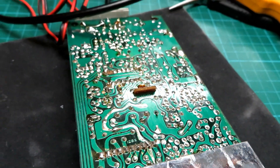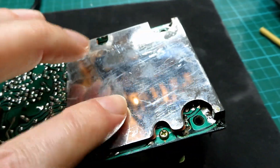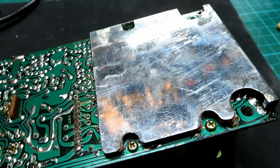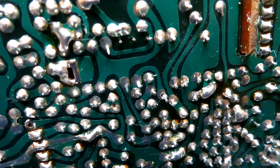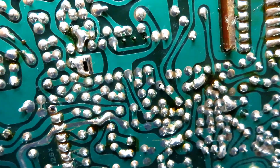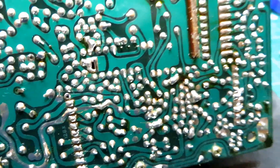I'm going to quickly rework some of that with the soldering iron and see if that brings anything back. We'll take this shielding off here — there's one more joint on the board. Sometimes if the radio has been in a damp environment or spent a winter in a boot, you can easily get condensation under these shields. Let's have a look — and indeed I think I've found the problem without even getting the soldering iron in there. Right in the centre of the picture you can see a little broken leg there, and that was underneath that screen. Always worth taking those screens off.